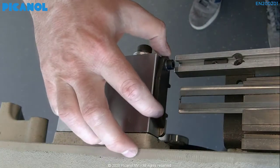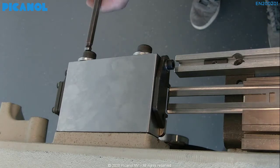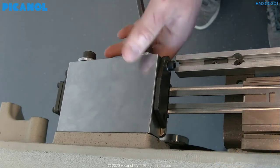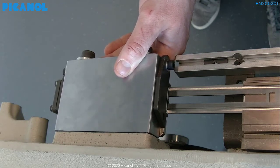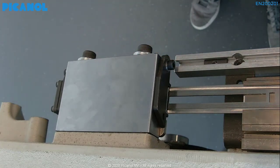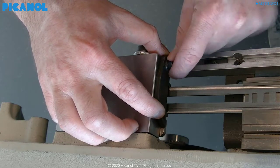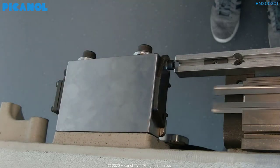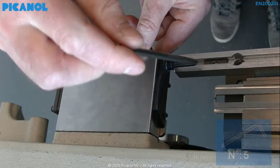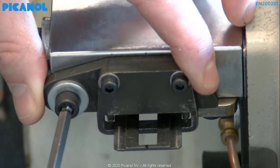Next, we are going to place the front and back terminal pieces in their correct position. First, make sure that the cooling block is placed high enough to enter the gauge. Enter the gauge into the front terminal piece and make sure that the gauge is placed in the center by shifting the terminal piece into its correct position. Moving the gauge in and out should be smooth and the caliber should not hit anything. Hand tighten the terminal piece and check again. Do the same procedure for the back terminal piece.